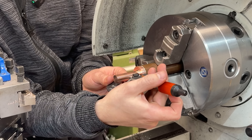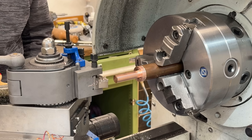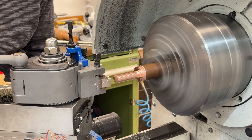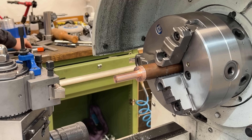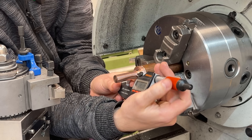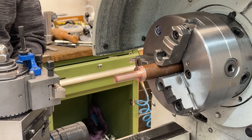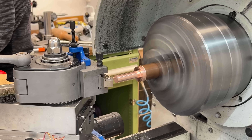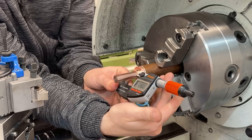I'm reading 14.4. So I now make two finishing passes with 0.2 depth of cut — my first diameter setting is 14.2. Let's check that: 14.19, that's okay. Now I set to 14.01, correcting one hundredth of a millimeter. And there we go — 14.0.